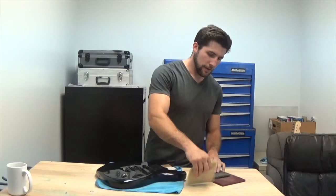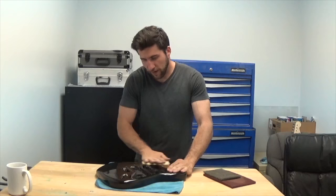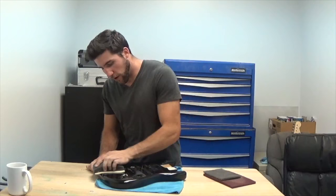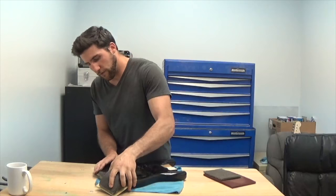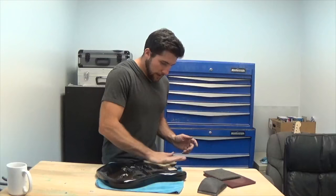You're going to end up with a very similar effect regardless of how you approach this. I'm going to start with the sandpaper and go over it all with 600 grit paper. If you can, use a sanding block for the flat areas — it will keep you from sanding too hard into your edges and it will prevent you from putting ridges in there by accident. If you sand with your hands, try to avoid using your fingers; use your palm instead.